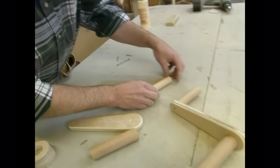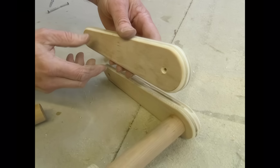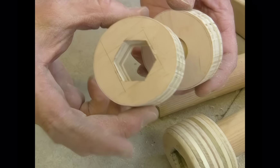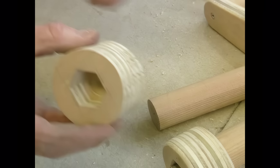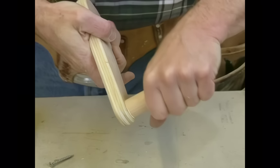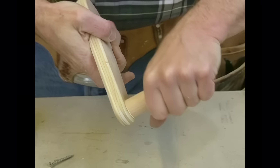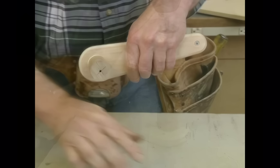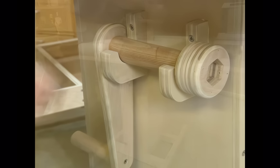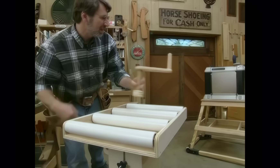Let's build ourselves a wrench. Here I have the various components: a one-inch dowel for the handle, a piece of plywood which I've shaped and rounded over the edges for the arm, a piece of closet pole stock for an extension, and two pieces of three-quarter-inch plywood — one is a backer for the socket. I'm going to nail and glue these together, round over the edges, and then put it all together. I've drilled a seven-eighths-inch hole about an eighth of an inch deep to give clearance for the shaft. Handle to arm, arm to extension, and socket to the extension. I've got a couple of brackets to hang it on the pedestal. That seems to work fine — ready for plenty of use here in the workshop.